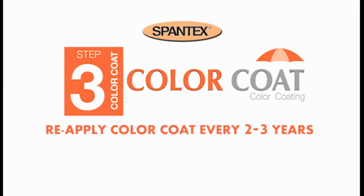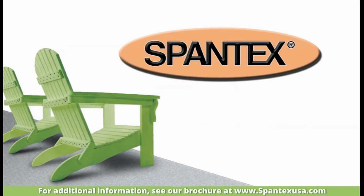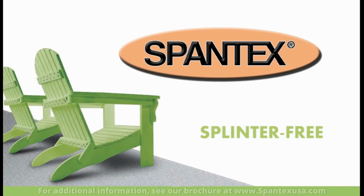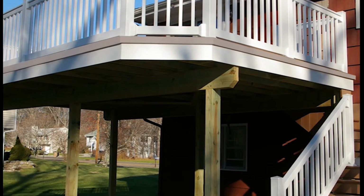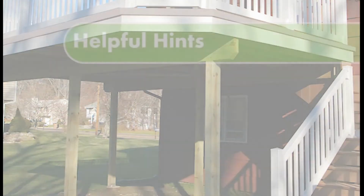For maintenance of your Spantex, reapply color coat every 2 to 3 years to keep a sufficient wear layer and to give it the much needed UV protection it requires. Now that the deck is complete, you will have a non-slip and splinter-free surface to enjoy with your family and friends. If you have applied the Tough Deck to a second-level deck, you will also have a sheltered and waterproof living space below to utilize for storage or covered living.